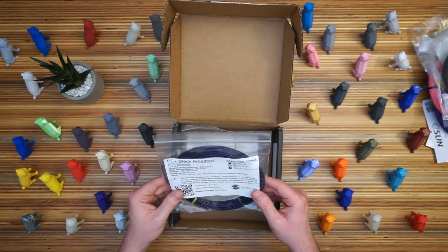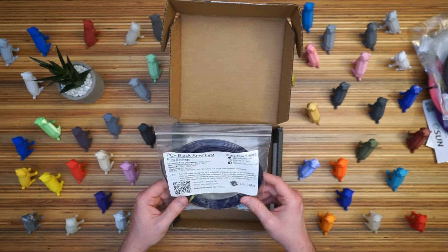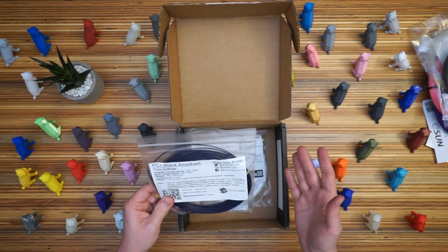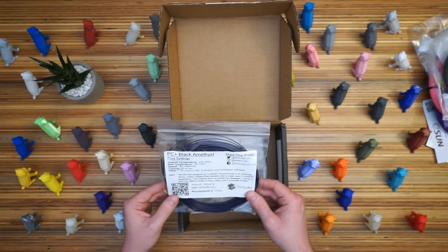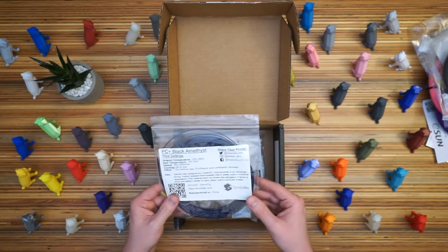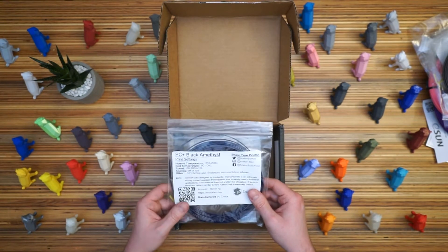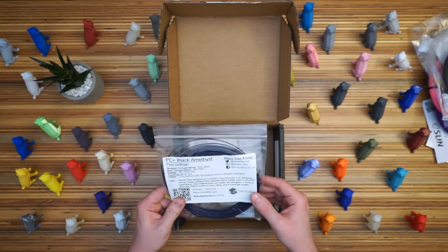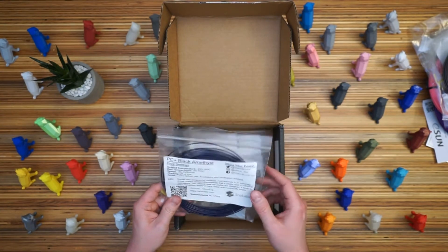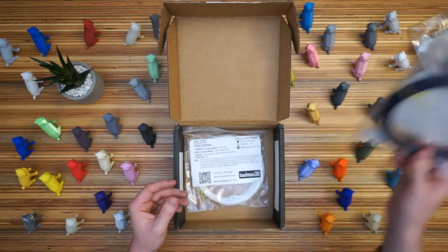Snow Labs is a company I'm not familiar with. PC — Polycarbonate. I don't know if I've printed polycarbonate. It says enclosure and ventilation advice, which I have neither of. Ventilation meaning it gives off some fumes which are going to be toxic or at least unpleasant. An enclosure is where you enclose the 3D printer so it keeps the air around the filament warm, preventing it from shrinking too much as it cools and coming unstuck from the bed or even unstuck from itself. So without ventilation and without an enclosure, I may not even attempt to print this — just save it for a later day when I have a better setup.